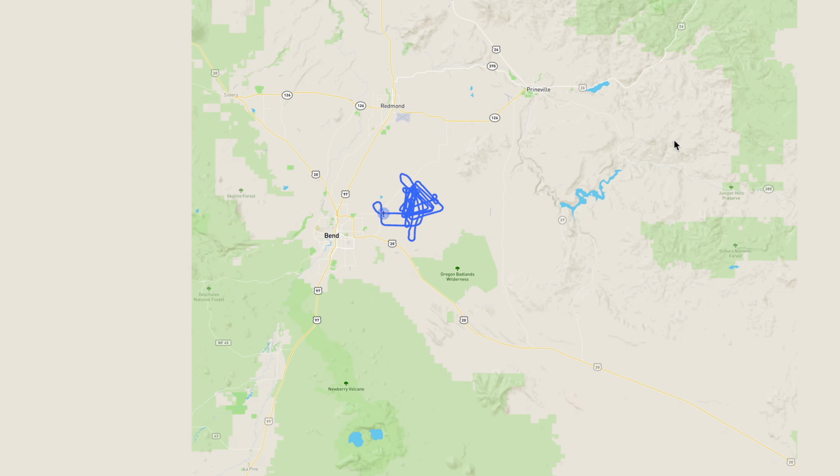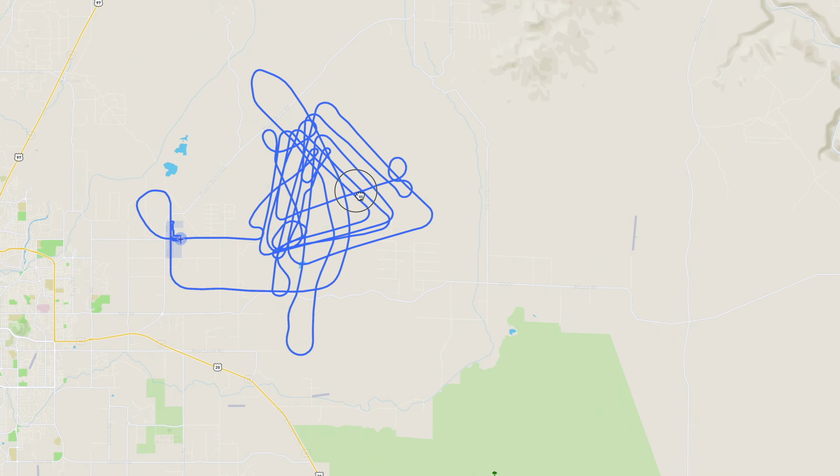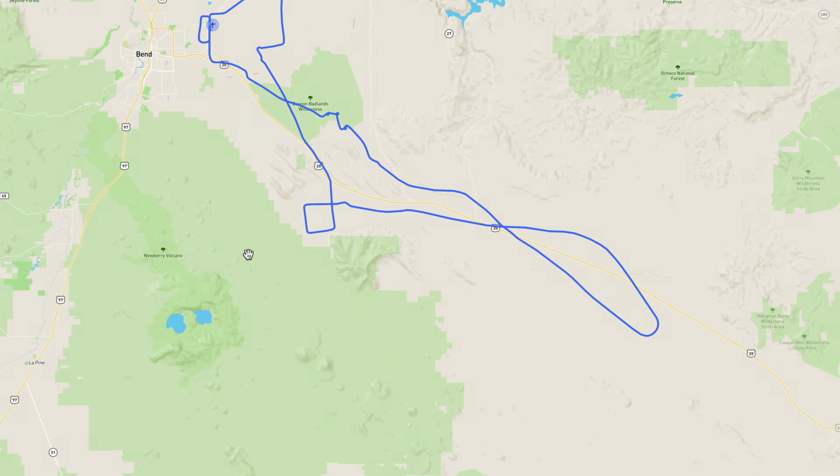All right, let me zoom way back out to 30,000 feet. Let's reestablish the objective. It's to establish the error in our Pitot-Static system. Now, the way we do this is by collecting precise airspeed data over time and patterns that zero out any effect of wind. You have a choice of flying either on a zero wind day, good luck with that, or you can fly a triangular or a square pattern to average out the wind. I'm going to do both patterns because there ain't no non-wind days out here.